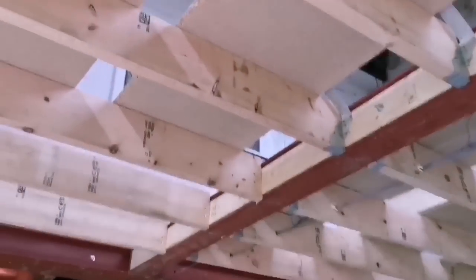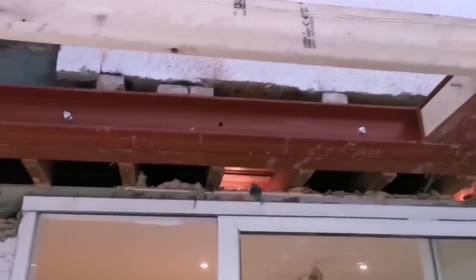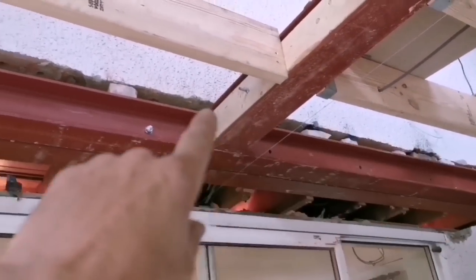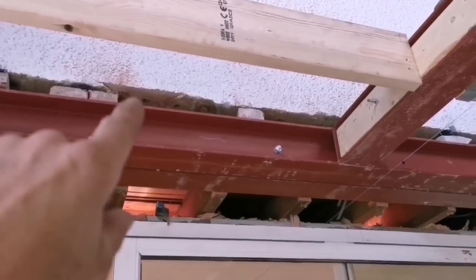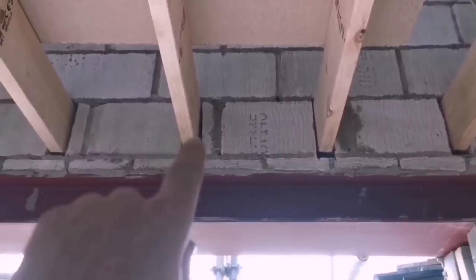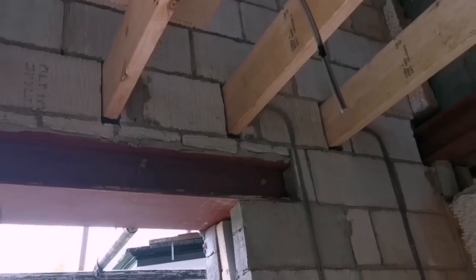That's the joist done, and took the props out, slated up for now, and then I'll put some wet bricks in before we go home. Don't want to put them in yet in case they move about. And then we've slated all these level, and then all these will get cemented up, but we'll do it at end of day so we can set.